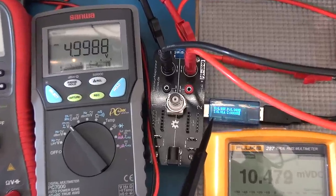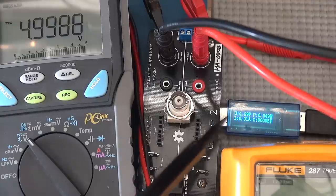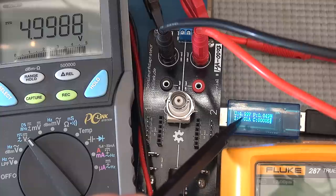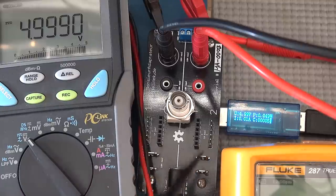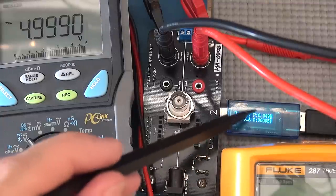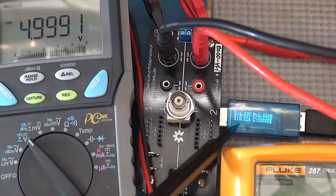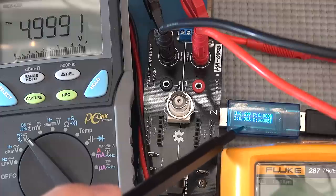Looking at this device, it's saying 4.99 volts, which is within its resolution and accuracy claim of around one percent — certainly no issue there with just over five volts going in. You can see it twitching. It's got a power reading in watts and the current is reading 0.01, so 10 milliamp — it's just flickering, but remember this isn't built to have that resolution.